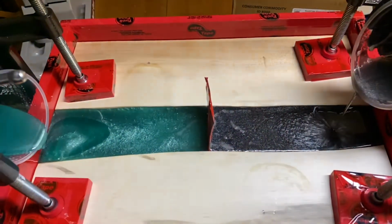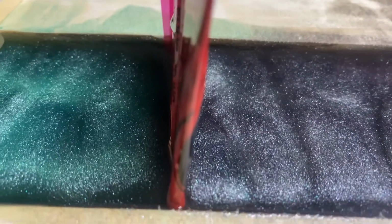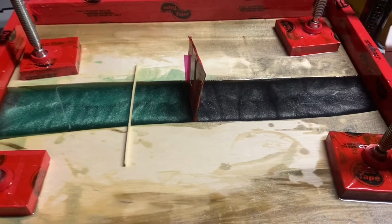We are checking in here at about the 10th or 11th hour, still really liquid, starting to get some nice swirls in here. You'll see we ended up with an underpour of about 1/8 of an inch, which is fine. That'll be taken care of in the finishing process and stages. We'll pull that dam out. That'll lower it even more here shortly.